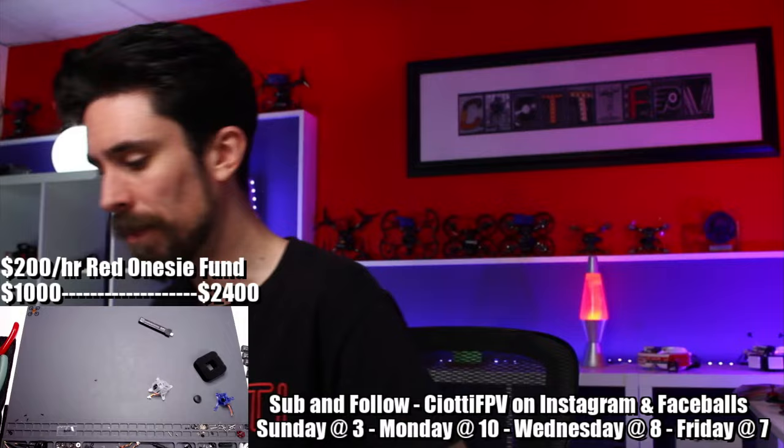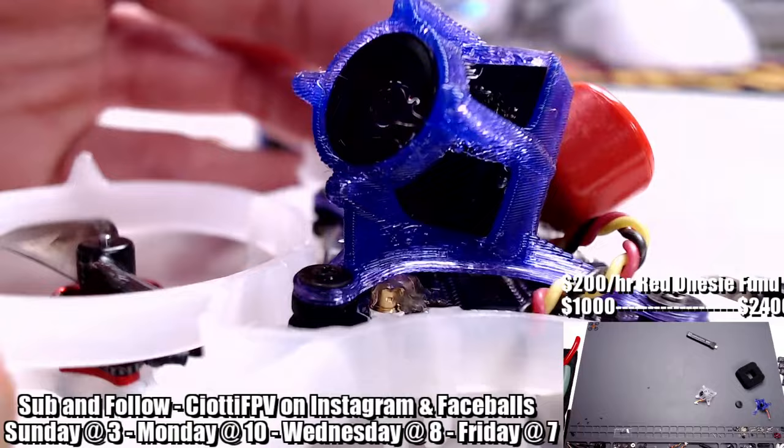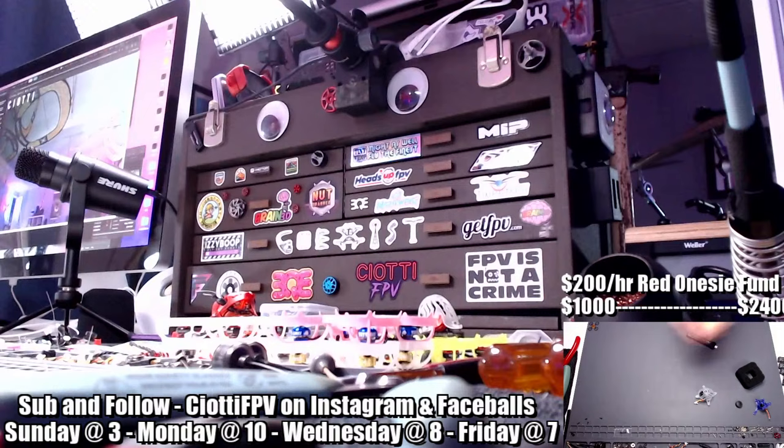So look right up in here, look at the UFL. See how that UFL is pushing there? You can really see it. You can see it literally pushing up on the TPU. That's not good. And it kind of does it on one side more than the other, so it cocks the camera over ever so slightly. Not so much that I fly like shit.